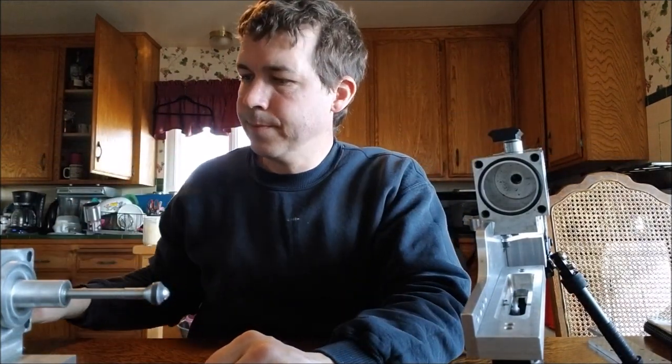That's the basic concept behind this valve design. The concept is not mine — I built my first gun using this type of valve about 15 years ago and I don't remember where I got it. I'd like to give credit where it's due but I'm not sure who originated it — so whoever you are, thanks for designing a good valve concept. This is probably one of the more complex dump valve guns ever built. With the 45-caliber barrel, I'm shooting 45-caliber round balls of about 140 grains at 600 feet per second with 800 PSI — pretty good for such low pressure. I can pump it up to 800 PSI by hand with a leather-sealed hand pump, like the old air rifles used for Lewis and Clark.